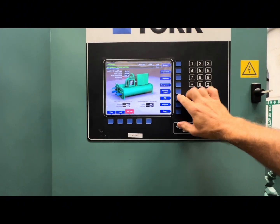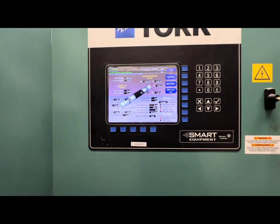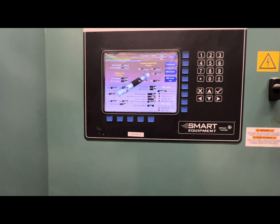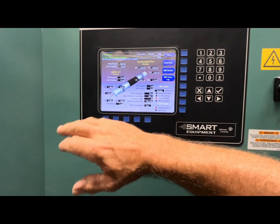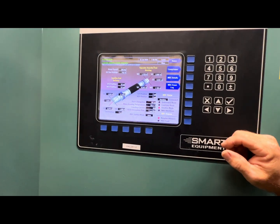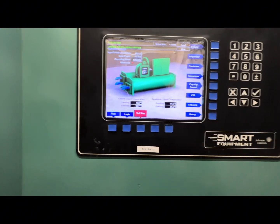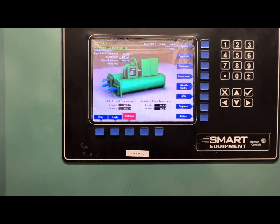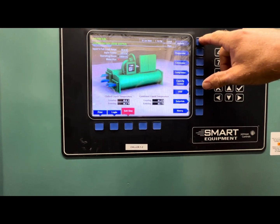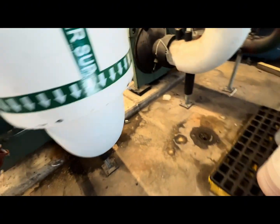What happened was this control here — the V13 position — it'd be running fine, go through its offload, and then all of a sudden get a slam shut. This would spike and go up to like 160-something microns. There were several of them in the log by the time we got to it, and it had tried resetting itself many times. Anyways, he determined that it was linked to the refrigerant control valve.